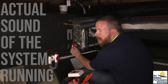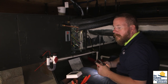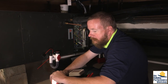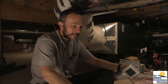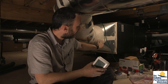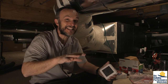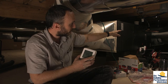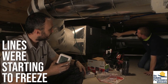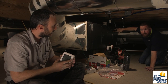It's always nice when you start up your newly designed duct system because you want to hear what it sounds like and whether it'll perform exactly like you wanted. That's pretty quiet. So we turned on the system, it runs, and you can hear and feel it run — but how it runs over the next couple of minutes is very important. You don't want to just turn it on and then leave. Brent found first that our lines were starting to freeze up — frost was building up on the refrigerant lines — and that's a key indicator that air is not moving like it should.